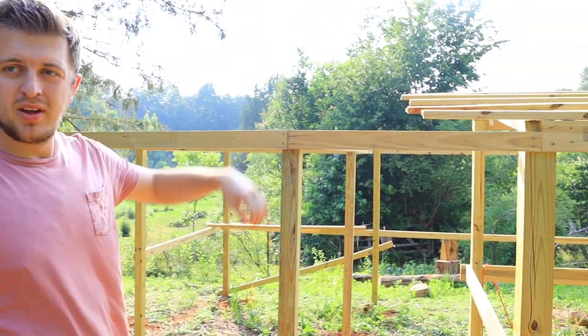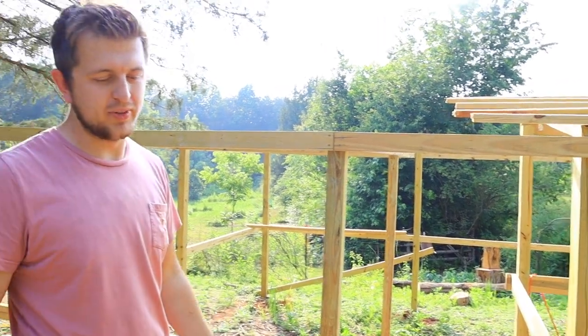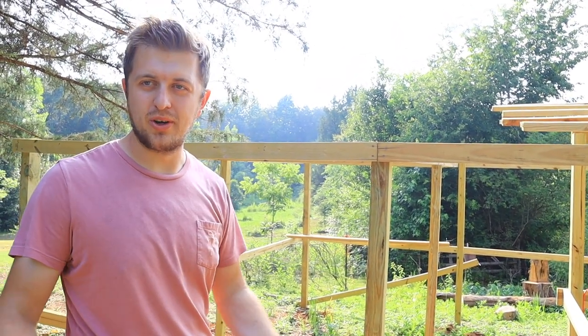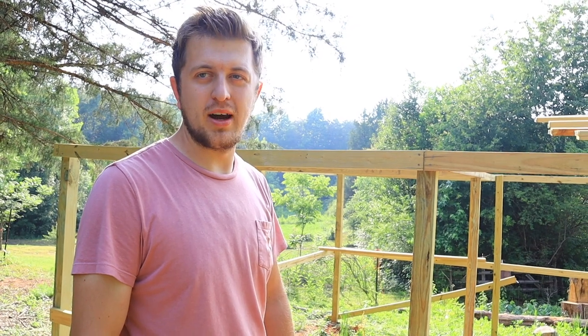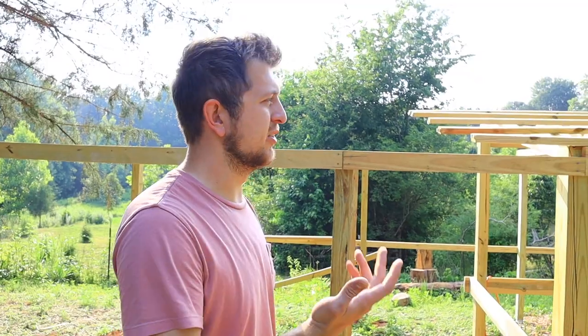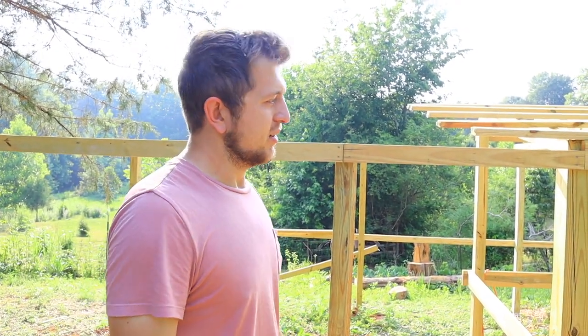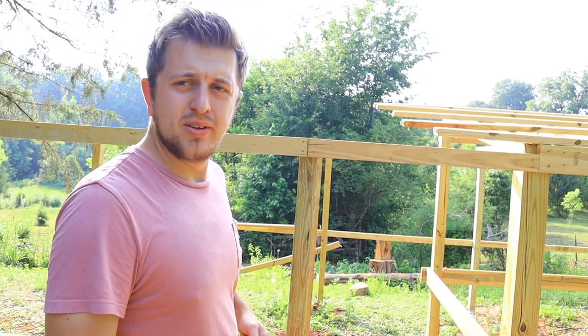It'd be really difficult if we just put the roof metal on top of those joists and tried to screw up the length of the joists. Usually you would put roof metal on a roof that has sheathing, like a house would have a solid sheet, but we don't really have a reason to do that, and 2x4s are a lot cheaper and easier to put up for us. They do what sheathing would too, where they stiffen up the structure a lot. So every board we put on this thing, it gets a lot stiffer, which is nice because it was kind of wobbly to begin with.